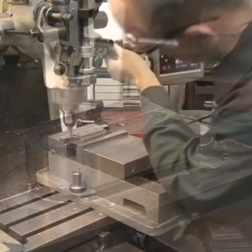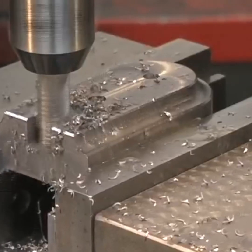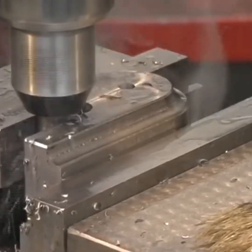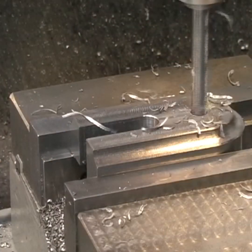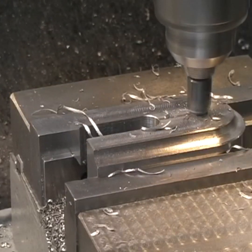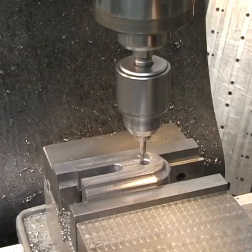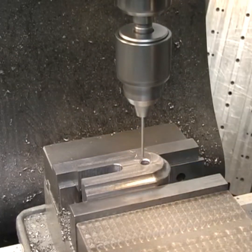We take the part off the plate and go into a regular milling vise. Here we're going to do the slot using a half-inch roughing end mill in two steps. If you ever run into any problems with chatter, simply slow the spindle down until things smooth out. Then I'm drilling out the bolt hole with a light chamfer for craftsmanship, then spot drill and drill a hole for a roll pin — this is just going to keep the post from rotating once it gets bolted together.